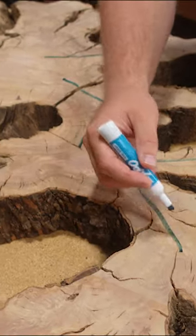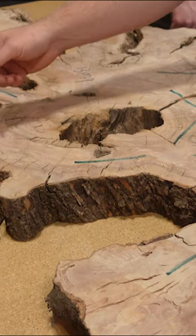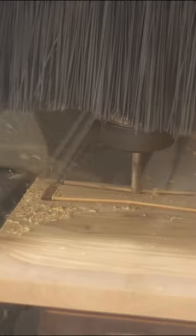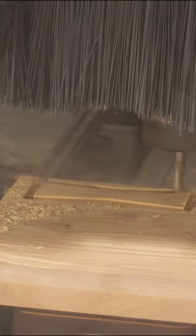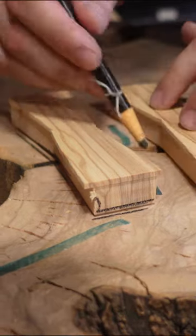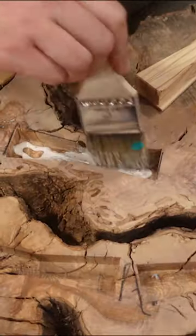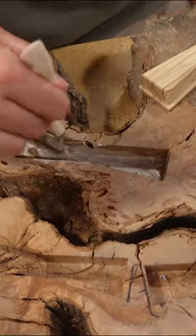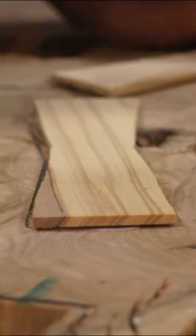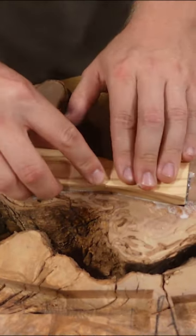This is going to be a custom wall art piece for our client. What you're seeing the boys do here right now is they're laying out for all of the structural bow ties that are going to have to get added to the back of this piece. We take another piece of olive wood from our stock and cut out all of those bow ties so that they can go into the back of this art piece. We're using Titebond 3 to secure everything in place. This may look a little funny from the back with all the inlays, but this was absolutely necessary to make sure that this piece wasn't going to fall apart.